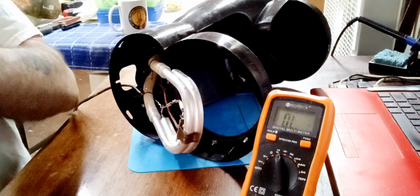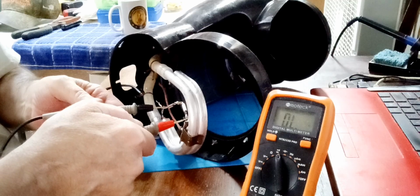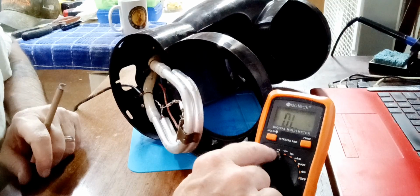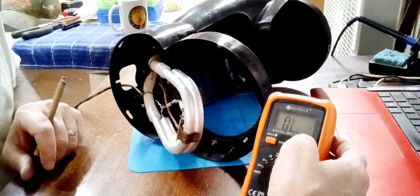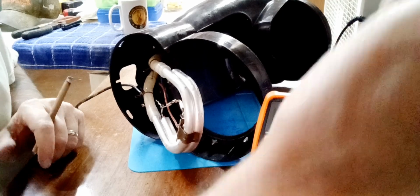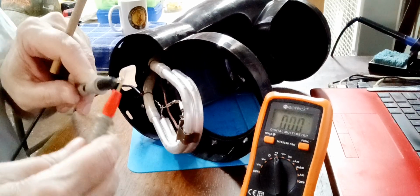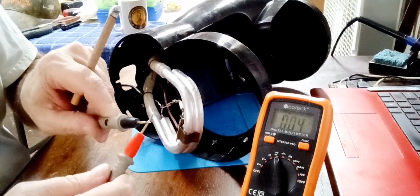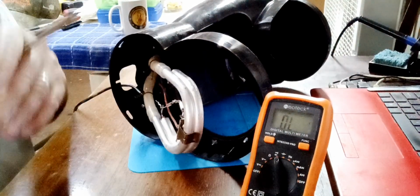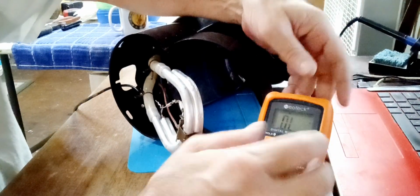And test this. And there we go. We didn't have that before. Now we got it now. Oh, and this is the diode mode here, and it doesn't automatically beep. It's just a function button. Now it's not going to beep if you put a diode in line, or you can just check for continuity. It's going to show 0, but if you put a diode, it's going to show the forward voltage on it. So, anyway, in order for it to beep, diode mode function.